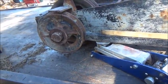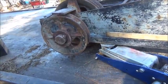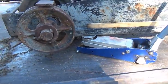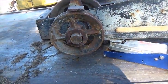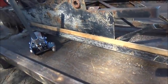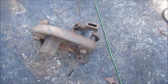I had a truck crane one time I got rid of because I didn't have the ratings for it — I couldn't read them on the aluminum panel and couldn't find them anywhere. If you watch YouTube you see a lot of cranes flip over, and it's not just from people doing stupid stuff — it's from misjudging. Ratings are there for a reason. In the recovery business you learn those ratings pretty quick because you can break something really fast if you don't do it right.